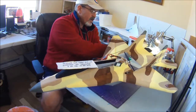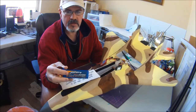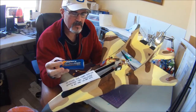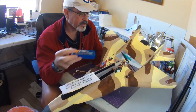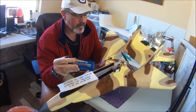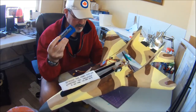So Stefan and I use these batteries a lot. They're Zippy Flightmax 2200 40C, like I said. These are a really good versatile battery for us. It's probably overkill. This is a 2212 2700 kV motor, the Focal Price, as you hear people call it. This one's actually from Deal Extreme, but it's the exact same motor. The highest I've ever seen them pull is maybe about 37 amps on a 6x3 EMP prop. So this is probably way overkill.